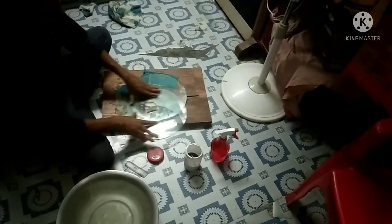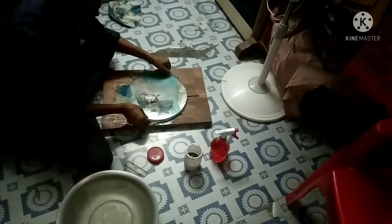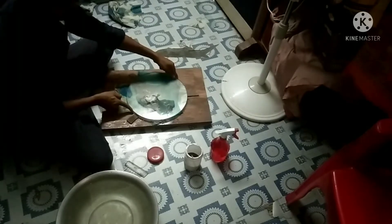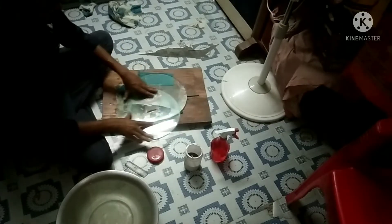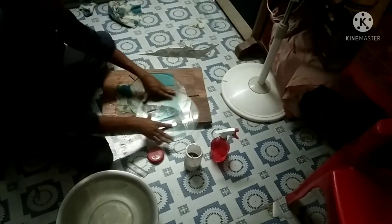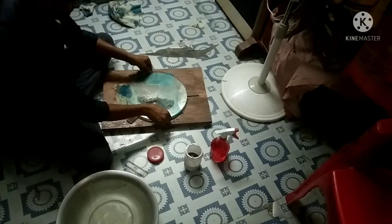After 15 to 20 strokes, rotate the tool a little bit anti-clockwise, and then rotate the mirror a little bit clockwise. Then draw the mirror again at 40% overhang.